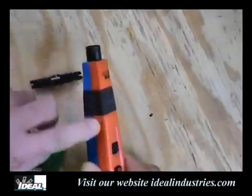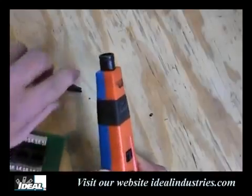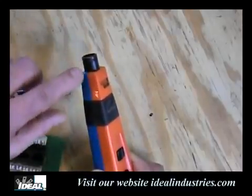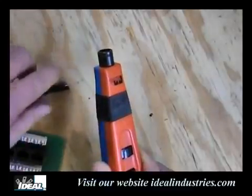And you'll find that the tools are color-coded, and this is blue and orange. The orange side of this tool, the cutting blade on here will line up with it, and that always indicates that the orange side of the tool is going to cut the conductor off, okay? And there's a little snip right there to indicate that's the cutting side of the tool, okay?